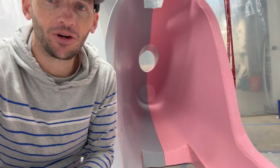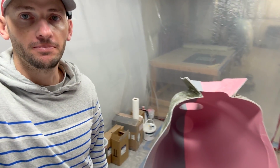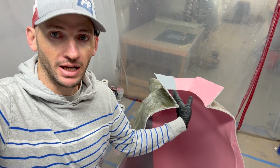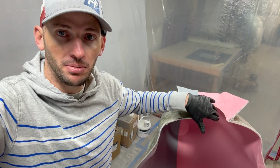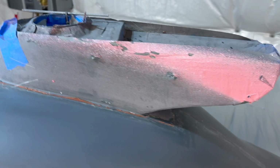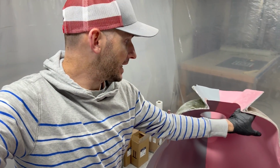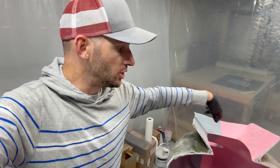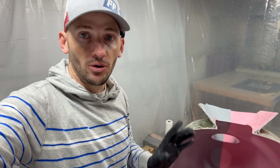Now, unfortunately, we aren't quite done with this mold. It's currently a 2-part mold, and I mentioned in a previous video it needs to be a 3-part mold, and that's where this comes into play. So up here there is a void, and if you remember from the last time, I didn't want to have to deal with the super complex shape of that, I don't know what we're calling, mast or pillar from the actual helicopter. And so I left these flanges in here so that we could close off the bottom and then make a 3rd mold to sit into this location and give me a nice smooth contour that I can lay up my carbon easily into. That will eventually be trimmed around that mast, and then we'll mount it to the helicopter, but none of that geometry is needed. So we need to make one more mold.